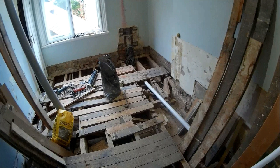Now you can see by the window there the soil pipe that I have been working on. I've made the new soil connector into it to the toilet. Below that is the old waste boss in the iron part of the pipe that's left. Now I've made in a two inch piece of pipe into that boss, sealing it up in there with silicon. I didn't get to film that sadly, but it is what it is.